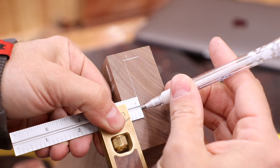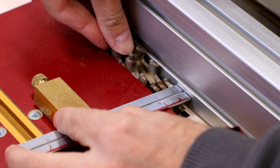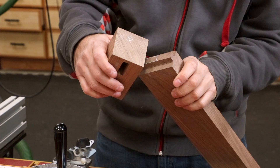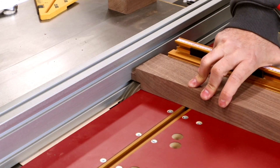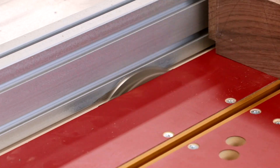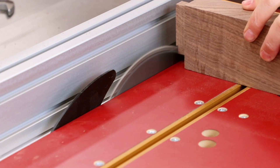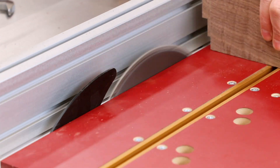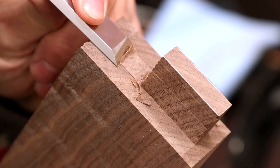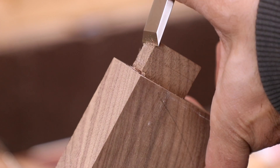Now for some tenons. I'll draw the full tenon onto at least one of the rail ends to get the tools set up. I'll be using the dado stack with a sled at the table saw, starting with a test cut and making adjustments from there. Once the tenon just starts to go in, I'll keep that setting and cut the rest of the tenons. For the bottom short shoulder I'll lower the blade — the top shoulder is too much for the blade size, so I'll cut what I can and then switch back to a single blade to nibble away the rest of the stock. Any material left on the shoulder can be chiseled away and the width of the tenon finessed to a perfect fit.